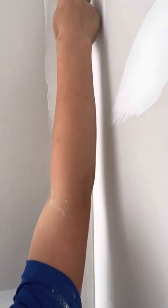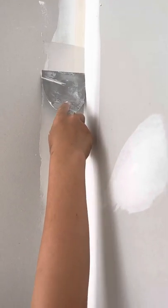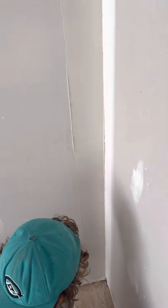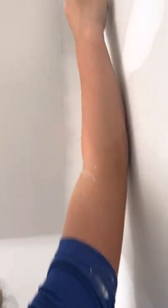See how he's angling his knife down? If he holds it out a little bit more — like that angle right there — and pulls it, it's going to even it out a little bit more. He's taking a little bit more mud off, taking mud off the angle, because what he's trying to do now is just get it smooth. Okay, now you're going to turn back and cut the edge — cut the edge.